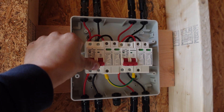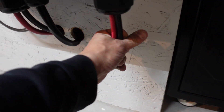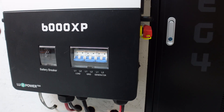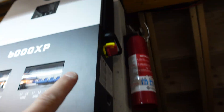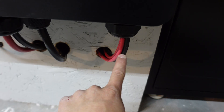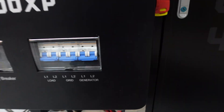Let's go downstairs and get this thing livened up to make sure it's all working. Three, two, one — okay, that's live. Red you're dead — that's how you remember it. Let's go downstairs and check it out. These lines should now be live. There's not going to be much going through them obviously — it's end of day, probably less than 100 watts. This shut-off to the unit is not turned on yet; I'd have to turn it sideways for it to be on.